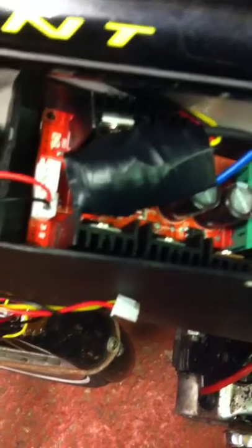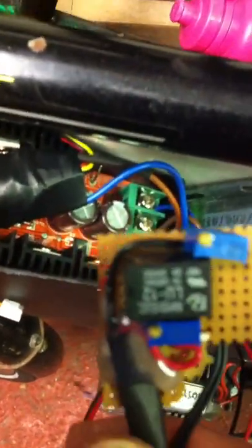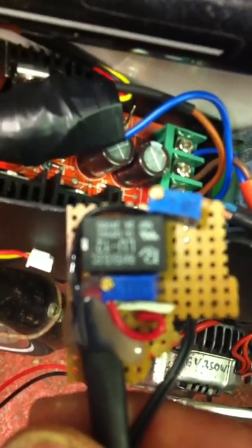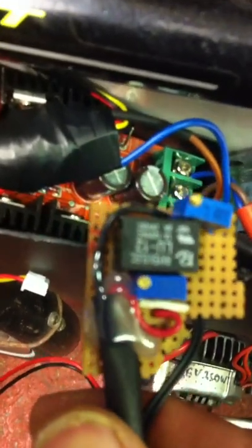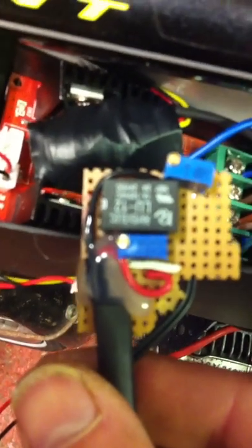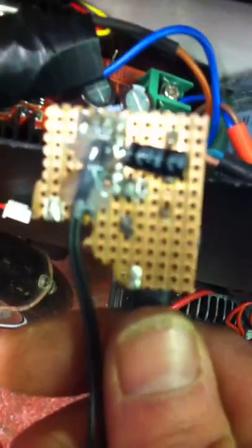If it ends up being too high there's nothing I can do about it apart from go for a lower voltage relay, which I haven't got. On the other end I've got an in and out that goes through the switching — a 20k pot. At about 9 volts output you get about 10k to the center, so I've added the potential to put another 20k on it, which gets me to about 20 volts, but that's again adjustable. In the normal state I've got a normally closed contact, and when it's energized it'll be normally open, running through that 20k resistor.